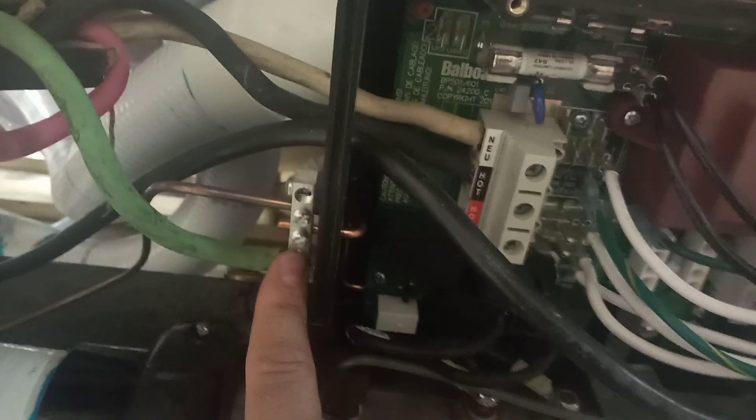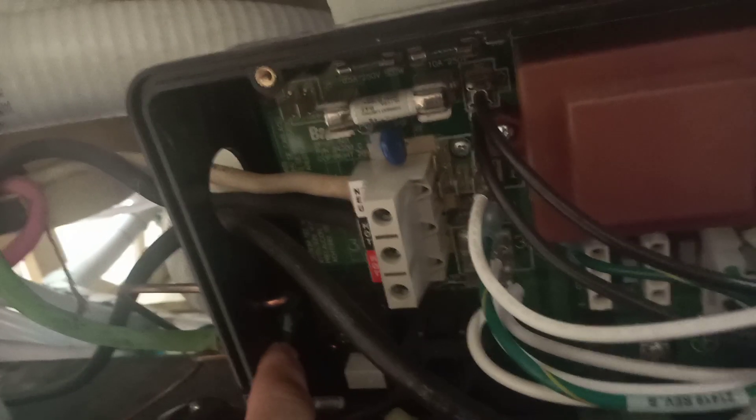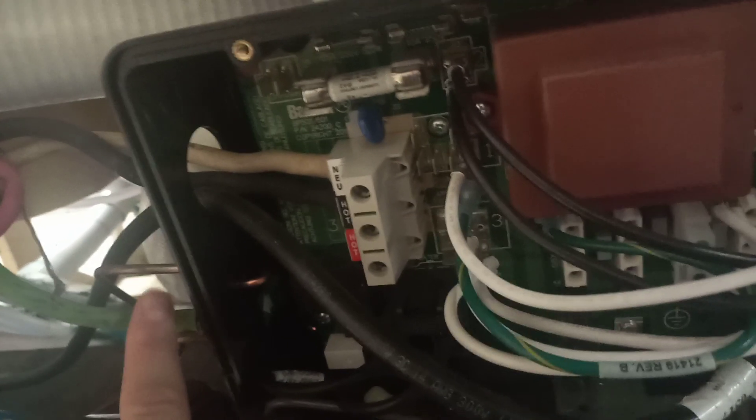On the outside electrical terminal, this is for the ground — you will put the green wire like so. You can also go in through this hole here. The wires are going to be a lot thinner with 110 volt; right now what I have is greatly exaggerated and that's only for 240 volt.